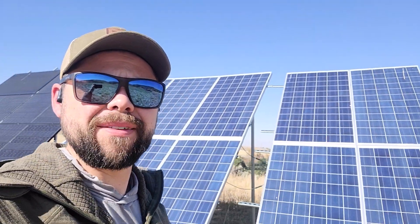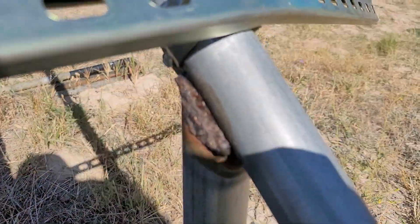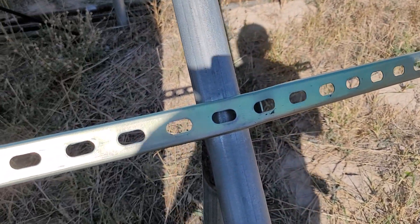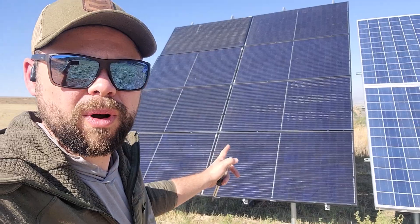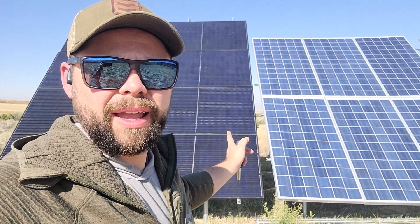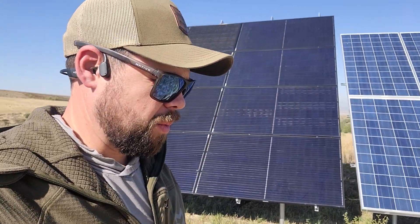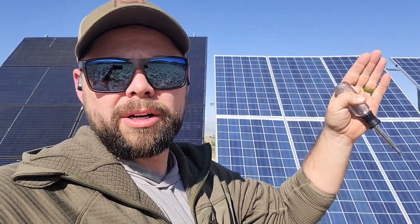I just really like having water at my off-grid cabin. These solar panels have been here for about seven years. When they were originally put in, this three-inch galvanized pipe was all welded together — pretty janky using this Unistrut with these older polycrystalline blue panels. Polycrystalline panels like this are way less efficient — I think these are like 300-watt panels, and right next to them are 400-watt panels. You can see the smaller solar panel actually has more than 25% more wattage. Right now this is running the well pump, but I now have the well pump hooked up to run off of the inverter and batteries 500 feet away, so we can get water 24/7.